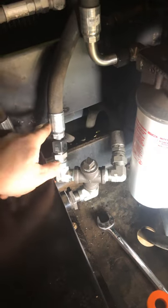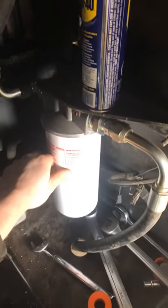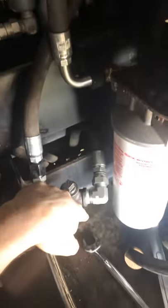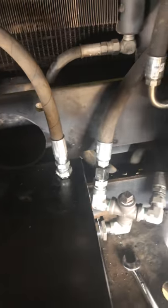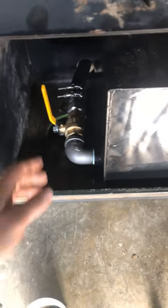This one here is return oil, so the return from the back of the tractor comes through here, comes through this filter housing here, goes up through our oil cooler, and then this comes back down in here and dumps into the tank. Then we've got a shut-off valve over here with a suction line run out so we don't have to empty that if we ever have to do anything with the pump or the clutch on the pump and open the system.